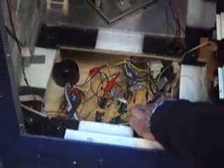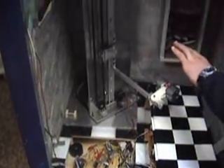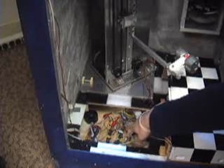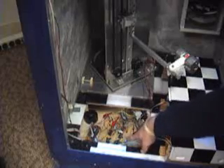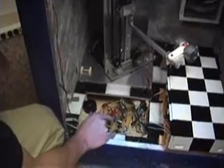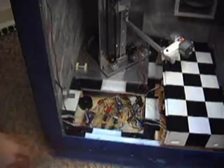And to the right is the arm PIC, which controls both DC motors, the H-bridge inverter, and the stepper motor, as well as the CD tray for all operations of retrieving CDs. It has nothing to do with the automatic selection — all it gets is the CD number and when to open the tray. Up here is a diode array, which is used in conjunction with the stepper motor to make sure there's no flyback voltages. Below it is the PIC, below that is the H-bridge, and below that is an inverter. The power for the DC motors is handled by relays, and we also use track selection, CD power and play buttons, and the open and close tray with the relays getting signals from the PIC.